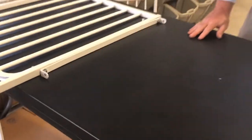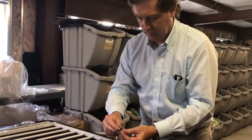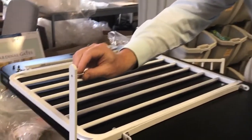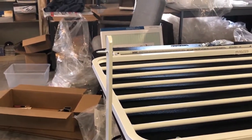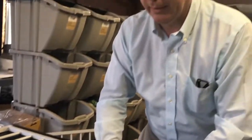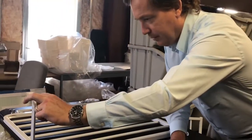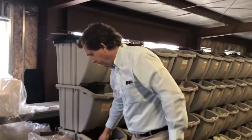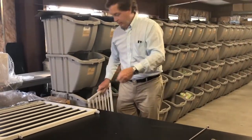Now that you've got that, you'll want to use the 2 wood screws that came in the hardware pack, and you will put those through the holes in the T-bar and secure that to your deck. And if you've got masonry or brick, you'll need to do some sort of drilling and then masonry anchor. But what you've made now is a fence that is absolutely rock solid and rigid. So you've got your 44-inch fence made up of the 2 extensions, and you've secured the T-bar and the T-bar hinge bracket.